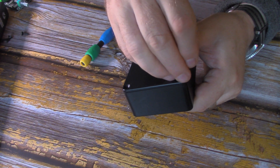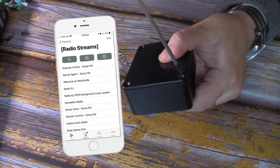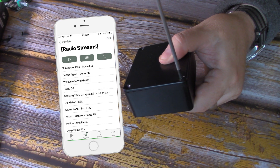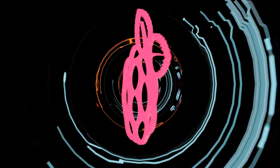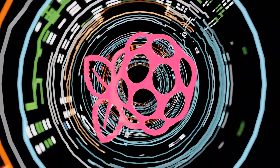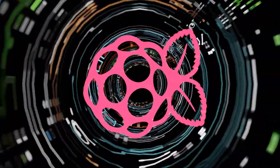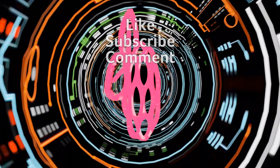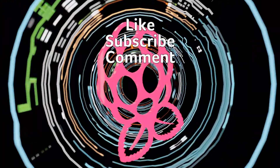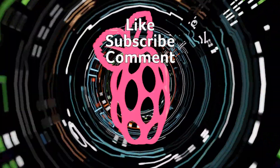It works and can run off a USB cable connected to a wall socket or an external battery if necessary. The only limitation is that it has to be in wi-fi range, so depending on location I can even use it outside in the garden. Also worth mentioning: since the Pi Music Box platform is based on Mopidy, you can use any MPD client to remote control your radios, and these come in all shapes and sizes on all platforms including iOS and Android. I hope you enjoyed this romp through making internet radios — I'll add lots of useful links in the description.